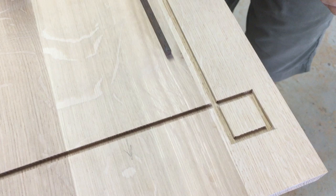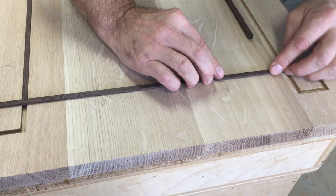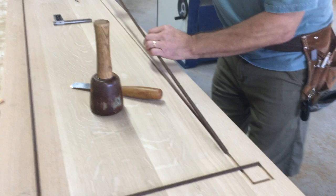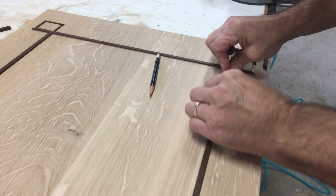I've already cut some of the pieces for this. The idea is that these long lines will meet these cross pieces here. The fit should be such that you actually have to press it into the groove — it should offer some resistance, and if it does then you know you've got a good fit. There's that piece there, and then this long piece will butt to that, and that gets pressed in all the way down the line. Eventually this is going to get hammered right to the bottom of the groove once there is glue in the groove. So clearly this is just a dry fit now.